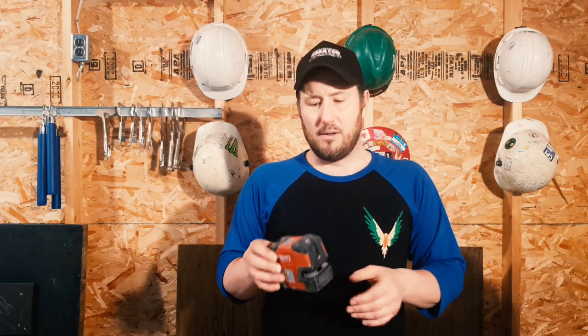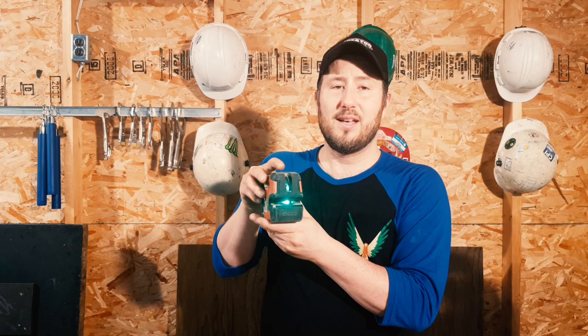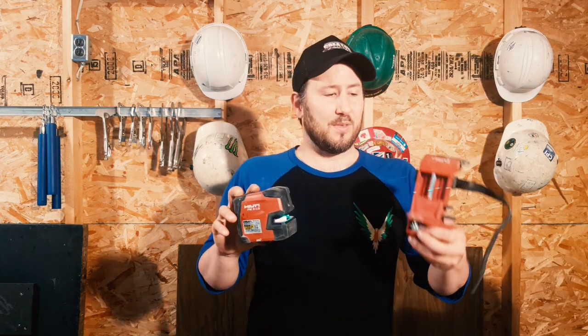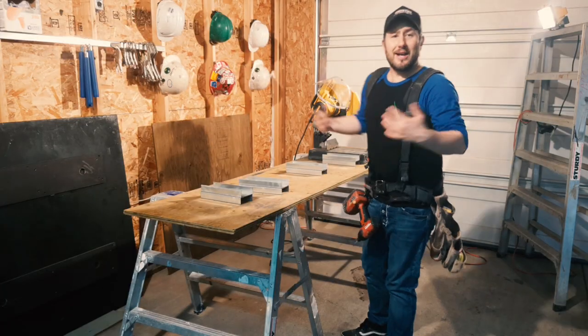We have the line laser. This laser is so important for framing and drywall — you will level your sheets with it, level ceilings, level studs, and mark your track lines. The green line is a really handy one, you can see it better than the red, and it's got vertical and horizontal lines. You use it to level doors, you just use it all the time. A line laser is an absolute must. The Hilti is a little more money but you can buy a dual one for around $150 Canadian. This is the actual mounting bracket for ceilings.